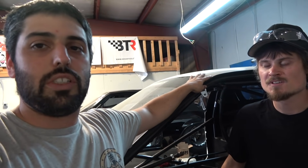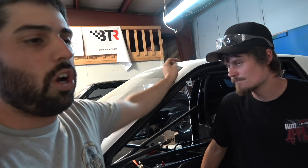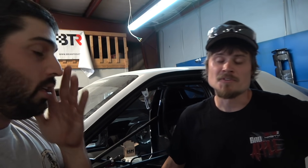T7 flange - they don't make it, so he drew it up and T-Cam Performance is cutting it for us. The hot side instead of being three-inch, which is a no-brainer, is now three and a half inch and we're going to use different thickness material. We were on the phone with Stainless Bros and Tycon Industries, had a great conversation, and we're going to be working with them for all of our hot side material. They've got double slips, they've got three and a half inch.